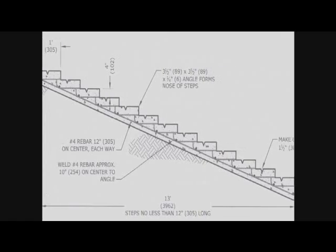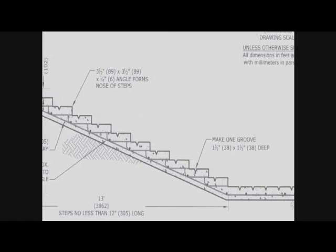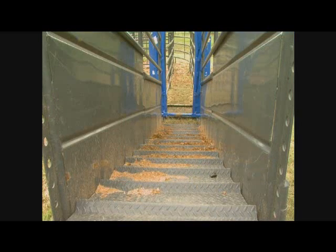Because if you just groove a concrete ramp, they get all worn out and slick. If you have a wood ramp or steel ramp, you want to make your cleats eight inches apart so the feet will fit down in between the cleats. You can use a two inch by two inch hardwood cleat or a square metal cleat — both will work. You want those cleats eight inches apart so the hooves just fit down in between.